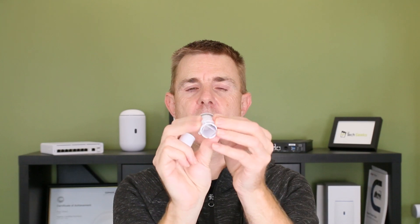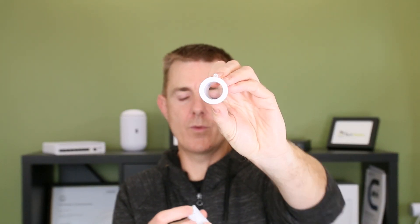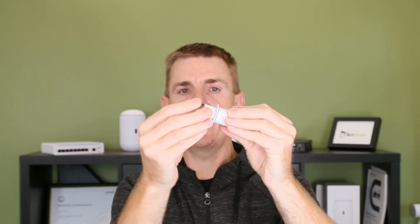Let's take one of our cameras — let's take our 360 camera here. We're going to pop out the tube that was in the middle, and we can see there's a very thin line in here. We can push the camera into place — and the camera is now securely connected. That's going to then have your fitting put in place and fit it to the wall or the ceiling. We're then going to take our connector cable — conveniently got a purple connector to remind you it only fits one way round. We're going to fit the purple connector in here, and when you do it the camera comes out the other end. Our cable obviously is through the other side of the wall — we are now going to clip that into place into our device, and here is now our setup.